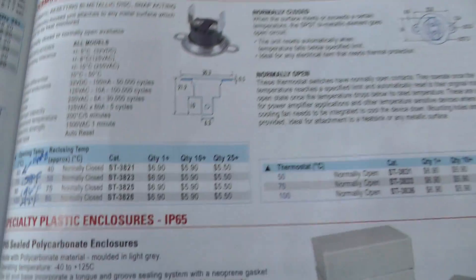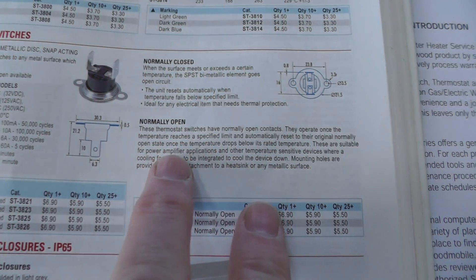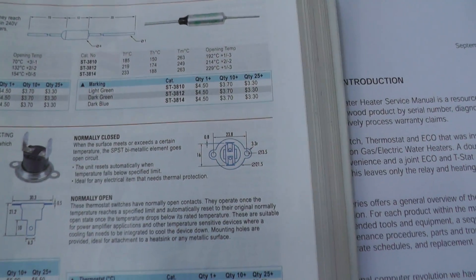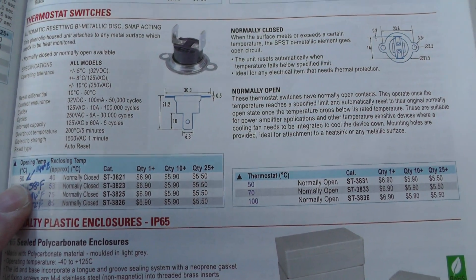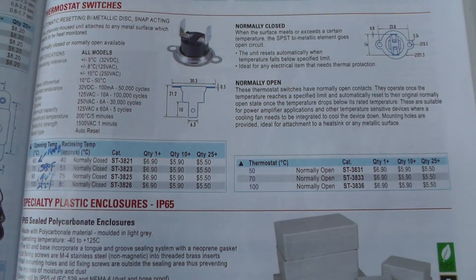In the case of New Zealand, the easiest place to get a replacement thermal switch was from Jaycar. They have a variety of different temperature models available. In their catalogue you'll see two varieties: normally closed and normally open. This particular water heater is using the normally closed one for both the thermostat function and the electronic cutoff. The thermostat function was a 140 degree Fahrenheit model when I took it out, which corresponds to 60 degrees Celsius. For pretty much seven dollars New Zealand, you can fix this particular problem.